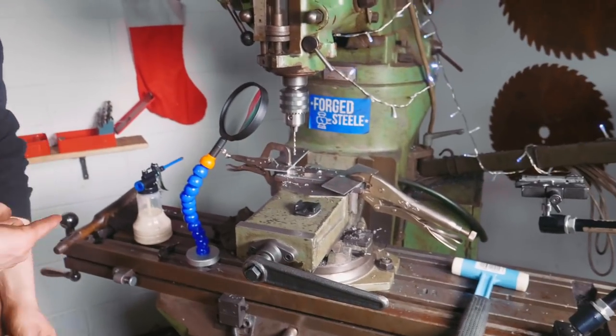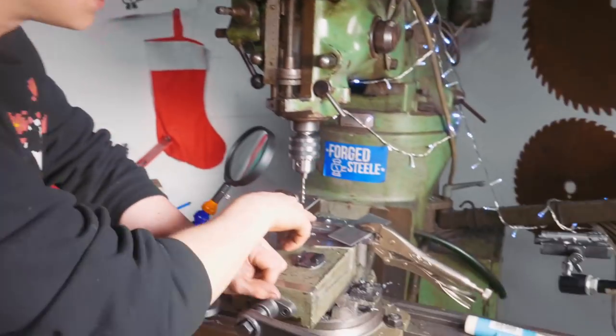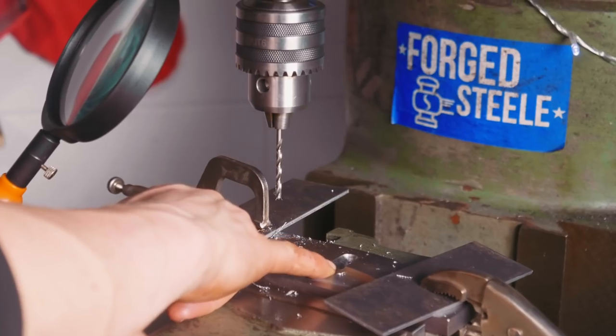Lots of you were commenting that I should check out Ekim Knives on YouTube, and he's got a 15-part How to Make a Frame Lock Folding Knife series. I feel a little silly for not having known that existed first — considering I'm a YouTuber, I should probably start YouTubing the projects I'm about to undertake. Ekim Knives, thank you for producing an incredible video series — incredibly helpful, especially about slitting what we're about to slit. I'm going to alter our little spring mechanism here because in his videos he described the measurements you need. I'm simply going to lengthen this and go about another ten thousandths deeper with the ball end mill.